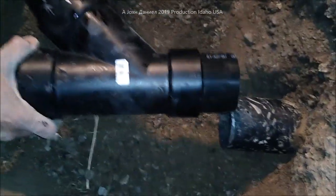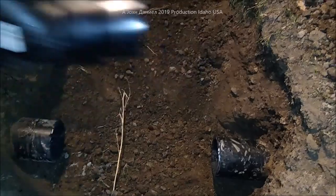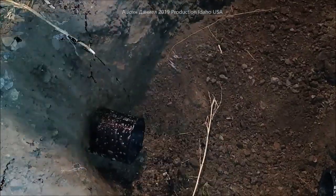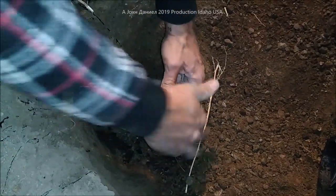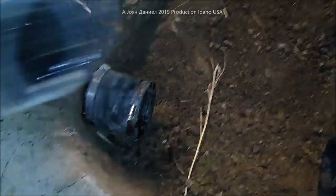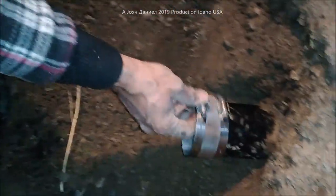There's our pipe out — there we go. We're going to try to do a quick fit. You see the little bit of slack that's there — that is on purpose, it's not going to hurt anything. A little bit of silt will build up in that gap. Now the first thing we're going to do is take a little bit of Fantastic cleaner, spray that in there so it slips on. Fantastic is kind of inert that way — it's not going to hurt nothing. We're going to slip it on and I want it to go past, almost where the pipe is exposed right there.